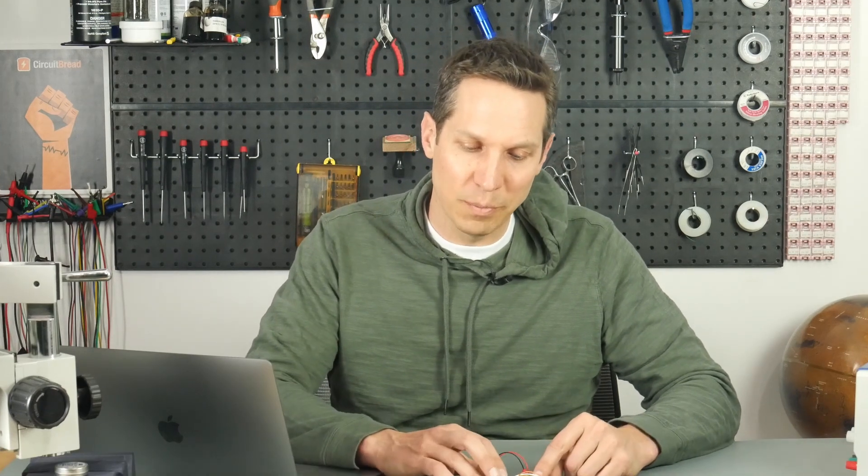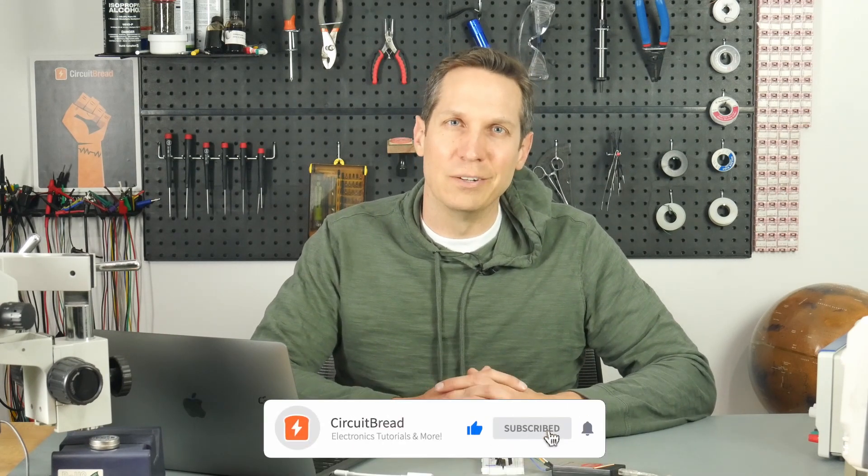That's about it for this tutorial. We learned about weak pull-ups, using inputs as well as outputs, and how the weak pull-up needs both a local and a global enabling bit — something to watch out for with basically anything on the microcontroller. The next tutorial will do the same thing using the MPLAB code configurator. Sergei's homework: make it so when you push the button it toggles, but while you're holding the button, it oscillates at four hertz — four times a second. If you liked this tutorial and found it helpful, please give the video a like, subscribe to our channel, and we'll catch you in the next one.